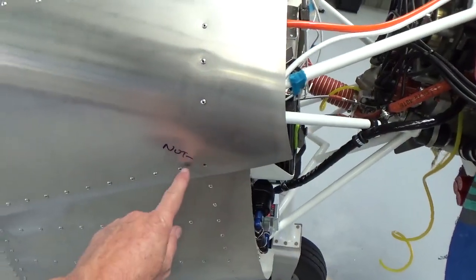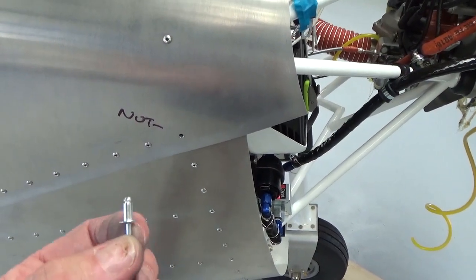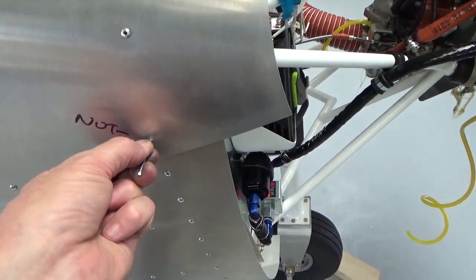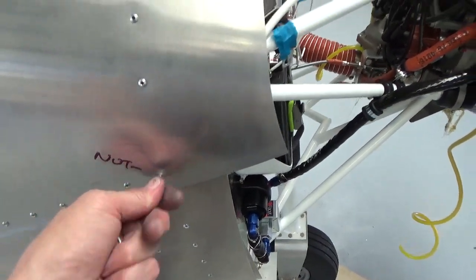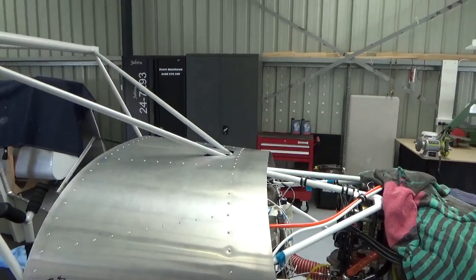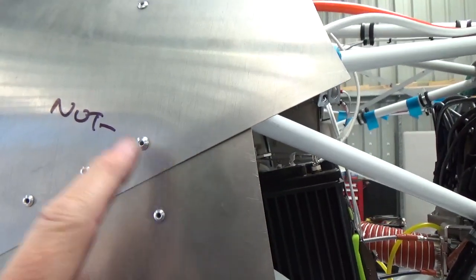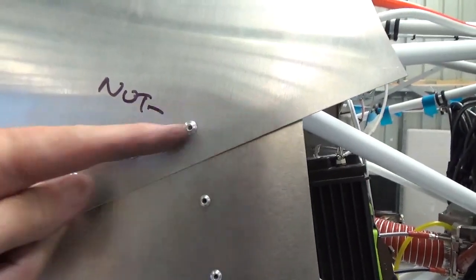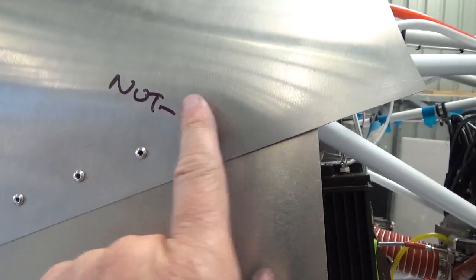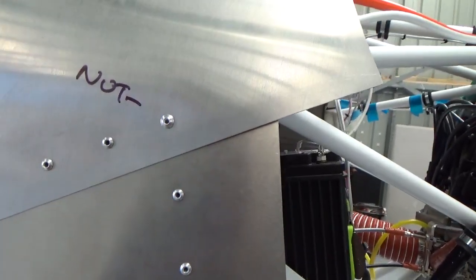Pro tip number 127. Where I position the engine mount, I didn't take into account these rivets. I've mentioned it before on forums. So I've got these shorter A5 rivets. Then hopefully that'll go in and won't hit the nut. The standard rivet hits the nut, same on both sides. I had a position like that on the wing, the top spar of the wing. There's a nut in the way if you've got that far yet, but looking good, going well. There you go. Just a slightly bigger head. Just aluminium rivets from the hardware store, just for that, the one that actually hit. So your engine mount is there. There's two AN3 bolts running through the longeron this way. So you want to try and position them to avoid these, as well as centre everything else.